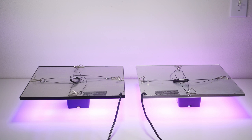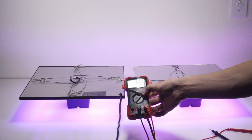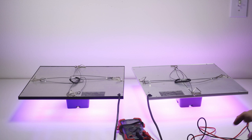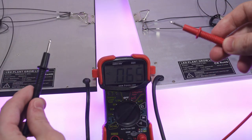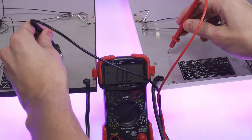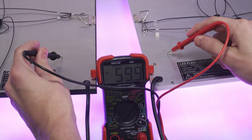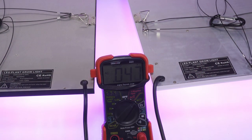I discovered this on accident when I was showing my collection of plants to somebody. I kind of leaned over, putting a hand on the back side of each light, and I felt a weird sensation — similar to if you put a 9-volt battery on your tongue. The electricity flowing through this is not extreme, but I busted out my multimeter to run a test, and I realized there's about 60 volts running through this thing, which is weird because it's about half the voltage of our standard outlets here in the US.